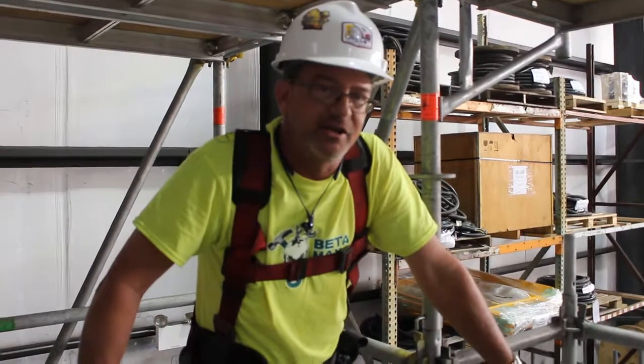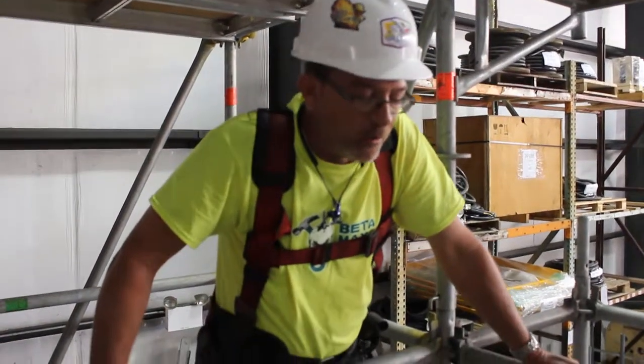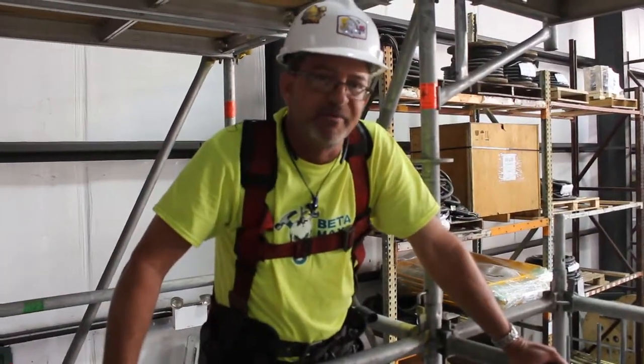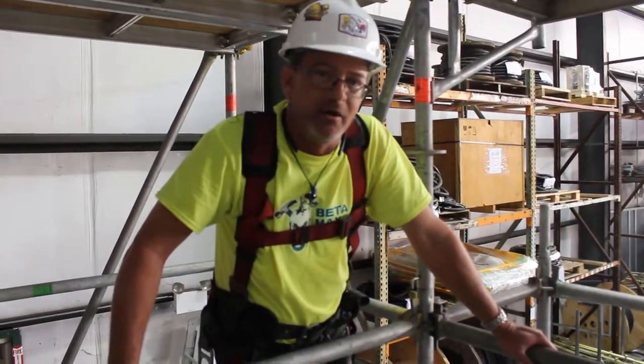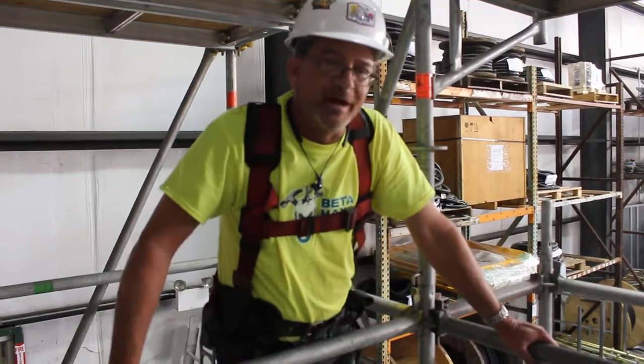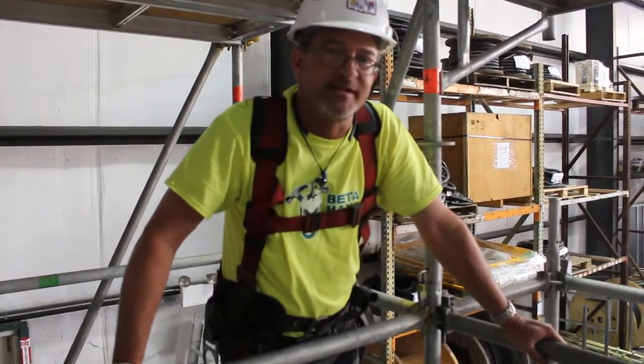With the carriage attached to the wire rope at this point, we raise the carriage and remove the bottom stop. Then we can lower the carriage with the down button using adequate pressure to ensure that the rope stays taut.